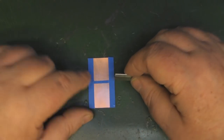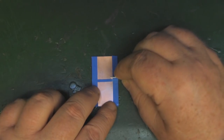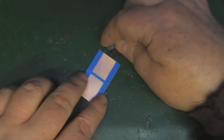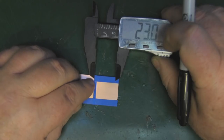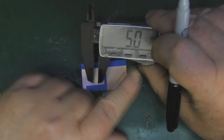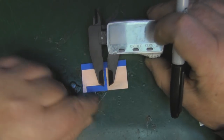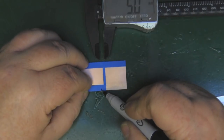Now I'm going to cut away the excess using this piece of tape as a guide. I've got my razor blade here and I'm just going to cut it off on this side so we've got a nice right angle, and remove this piece because we don't need it. Now I need to measure off 23mm to create the driven element — starting from the outer edge of the L-shape we've just made, I'll put a little mark at 23mm and cut away the excess. I've also got my calipers set to 5mm to put another little mark and cut with the razor blade.